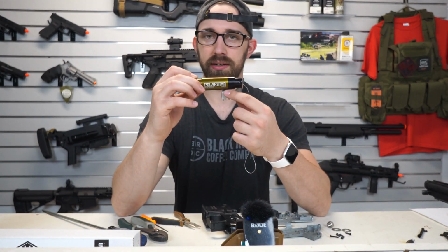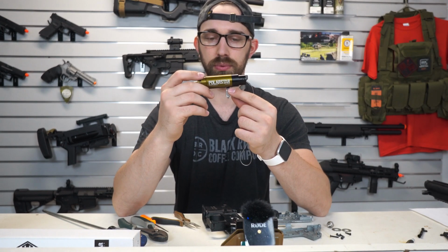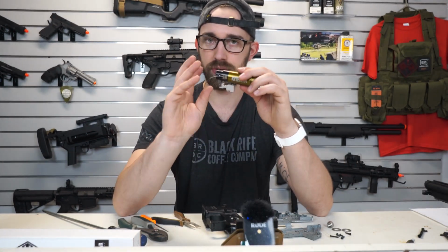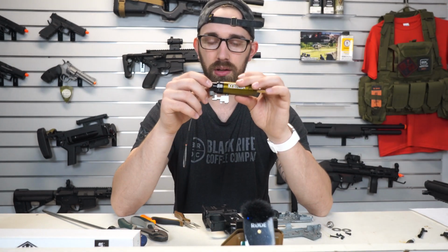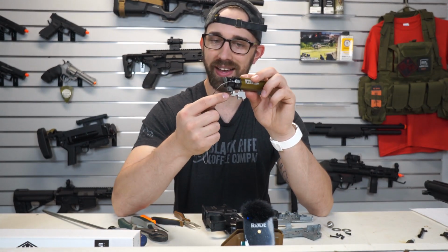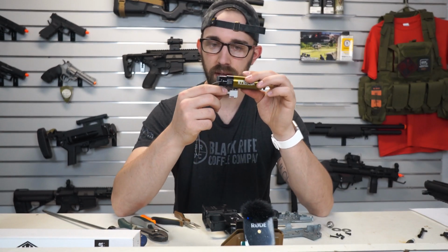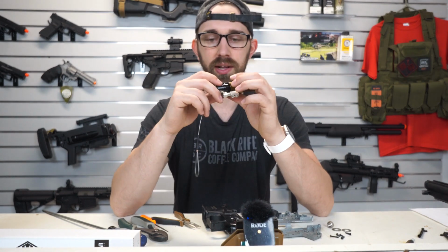The spring down here, in some cases, especially with the first batch, all came bent through shipping. Especially with this one, it did come bent, so I did have to flip it and then reinstall it with the unbent side sitting along the top of the solenoid there. There are 4 individual set screws that you need to install by disassembling the first block here and installing those in order to get the proper specs that you want.